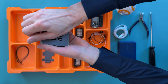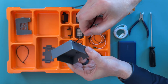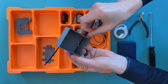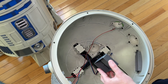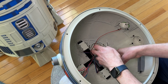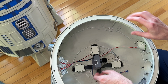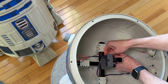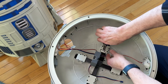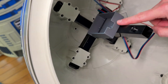Next up we're going to install the microcontroller into the center support mount in R2's dome. Go ahead and pull the lid off. You're going to want to take your two black cable ties and insert them through the triangle, teeth side down — do that for each one. We're going to go ahead and zip tie this to the center support. You want this to be fairly tight. One way to check: once it's zip tied, it should be able to slide up and down and stay put without sliding down. It doesn't need to be crazy tight, but you don't want it flopping around. You can leave the cable ties on or trim them off, then go ahead and push it down out of the way and we'll come back to it in a little bit.